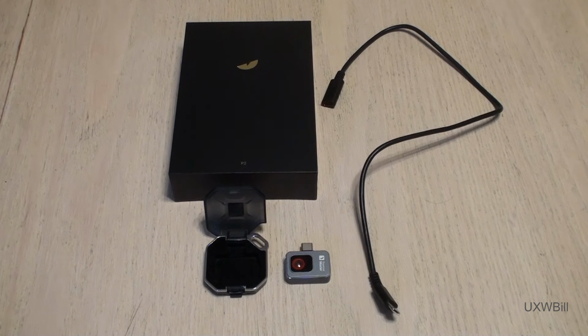I did notice on one occasion that the pointers and their corresponding temperature indication failed to show up while I was shooting a portion of this video. This, of course, is intended to have been a quick overview, and there are certainly things that I didn't mention about the functionality of the software. One of those is the emissivity control. You might need to adjust this depending upon what you're measuring and how reflective it happens to be. Thermalmaster does provide a quick guide in the manual to some suggested settings for certain types of materials.